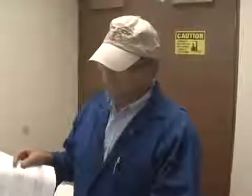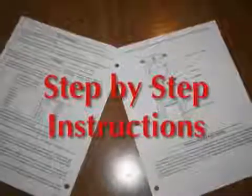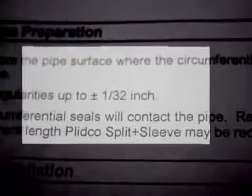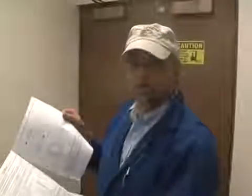There are step-by-step instructions for everything I'm going to show you in a short bit. Pipe preparation covers removing coatings, loose scale, and things like that from the pipe. The seals can only tolerate about a 32nd of an inch in pitting, so you have to have a pretty decent, clean surface. We do recommend that the coatings be removed from the pipe so the seals contact good, clean pipe.